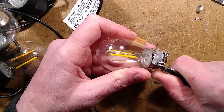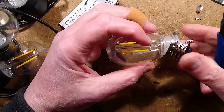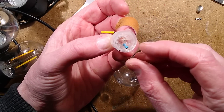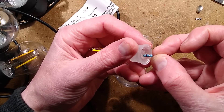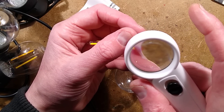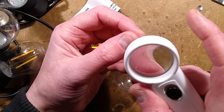So let's get this out here — the last bit is just proving irksome. There we go. The base is off, revealing the plastic housing, the glass support with filament, and it is pressed into a little plastic grip with a resistor. That's a multi-band resistor — let me see if I can read it or I'll just measure it. Brown, red, black, gold — the gold is a divider. Is that 12 ohm? I think it's 12 ohm.